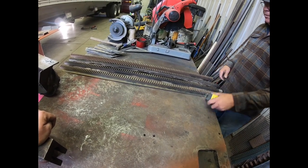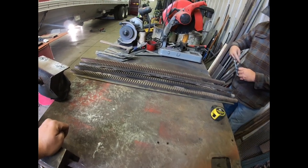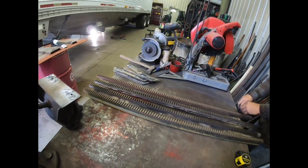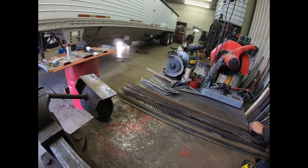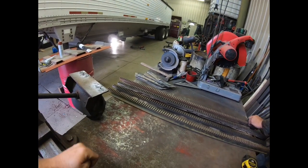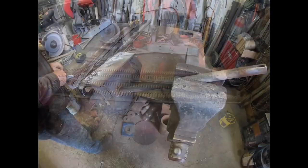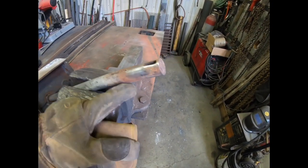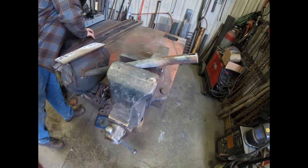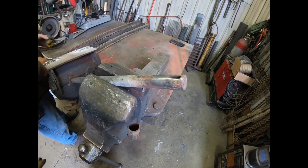Dad's gonna start tacking these together. Once we get them welded, we'll drill the holes — we'll have to measure out all the holes so that they're perfect, because you really don't want to re-drill the holes in the doors. If you're a half a hole off, you don't want to try to grind a hole out to make it work. On your gearbox shaft, go ahead and remove the keyway and take some emery cloth to clean it up so when you slide that new u-joint on it won't give you a fight, especially under the trailer. We don't need the keyway because it's all going to be welded together anyway.